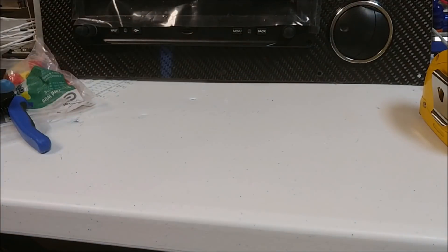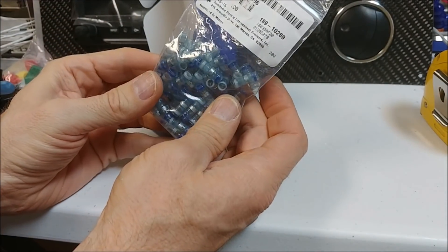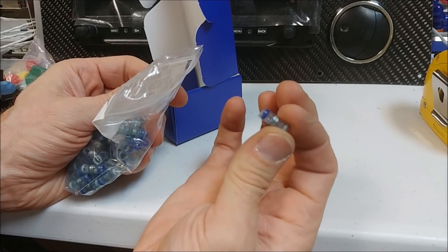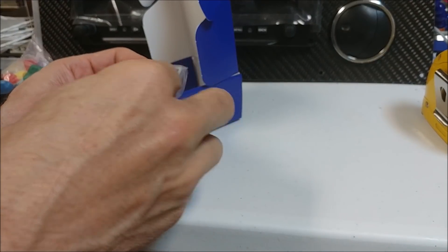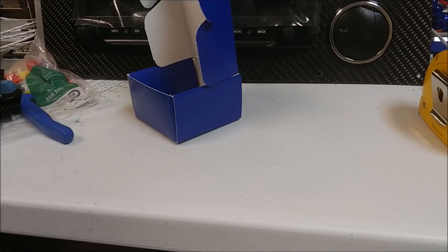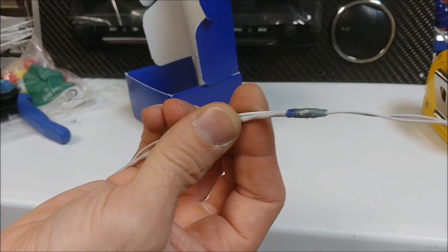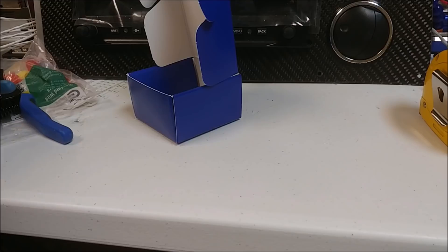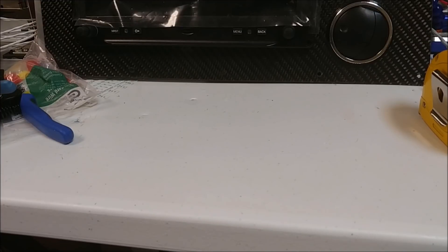These things aren't cheap, but you've got to have them if you want to do a good job. These are the solder sleeves — they come in different diameters. You put them over wires you want to join together, which is good for ground shielding or splitting one wire into two. You put it where the wire is exposed, run the heat gun on it, the heat shrink shrinks around it, and the solder melts and joins the connection — really nice. They're about a dollar each or so depending where you buy them, but they save a lot of time and do a good job.